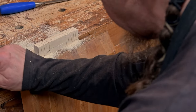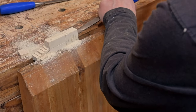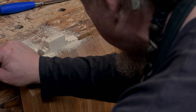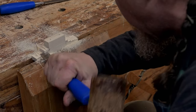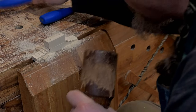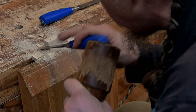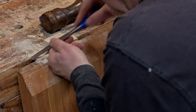You can clearly see how well the chisel just takes away most of that wood waste because of those little vertical cuts. He repeats this on the opposite side. It is not necessary to get down to the final rough depth on the first pass — in fact, you may not want to do that because you don't want to accidentally break into the contour line. Just be patient and do this carefully until you're used to it, and pick up different sized chisels if you need to. When most of the waste is removed, you can begin to chisel away to the contour lines.